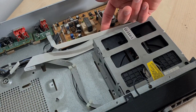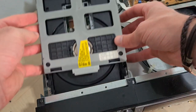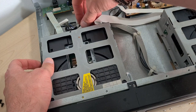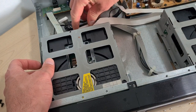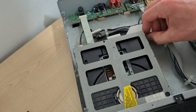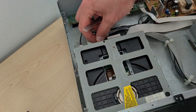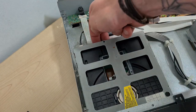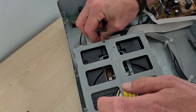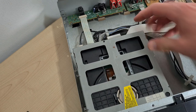Transport number two: cleaned, serviced, everything else. All that's left is to rebuild. Don't forget to reconnect this big long ribbon cable before you put the transport back in — just make sure it's seated correctly and all your connectors on the back as well. Make sure these are seated all the way before you press them down, otherwise you can't make a connection, and once they're damaged it's a hassle to find replacement ribbon cables.